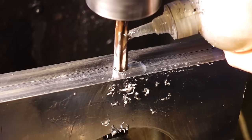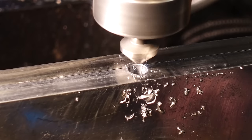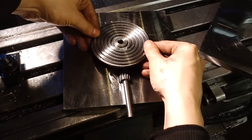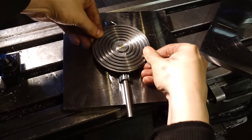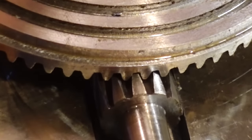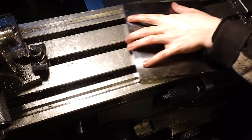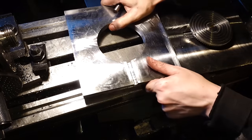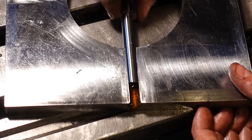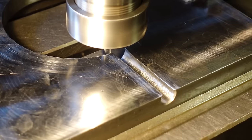Okay, so here you can see me using a hand reamer, and I've got it set up in the Bridgeport, running quite slow and with plenty of lubricant, but unfortunately the hole still came out absolutely horrible. I believe the reason is that the drill bit diameter I used to drill the initial hole was too big, and I was maybe a little bit too aggressive with it, which caused it to wander and score the sides, so when I went through with the hand reamer, it didn't really do much, to be honest with you. But it was still a really nice fit, so that's all that really matters. I know it would have been nice to have a decent surface finish as well, but...